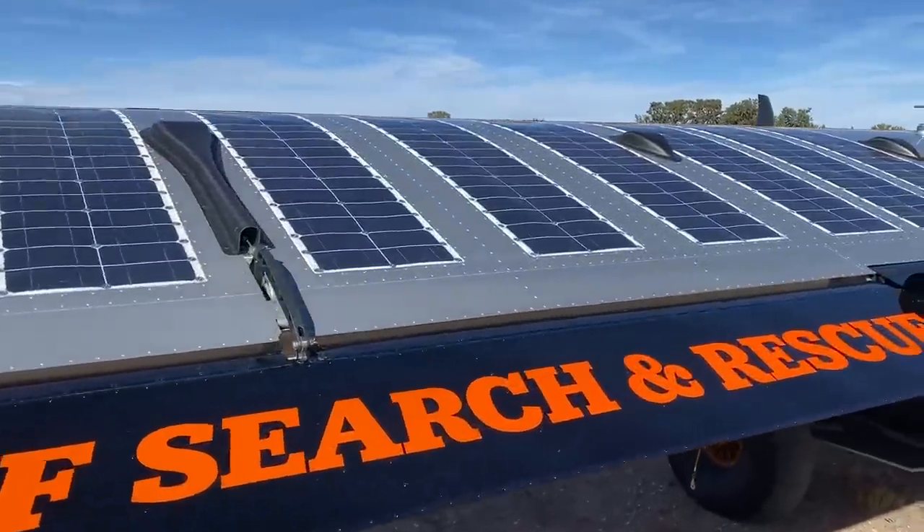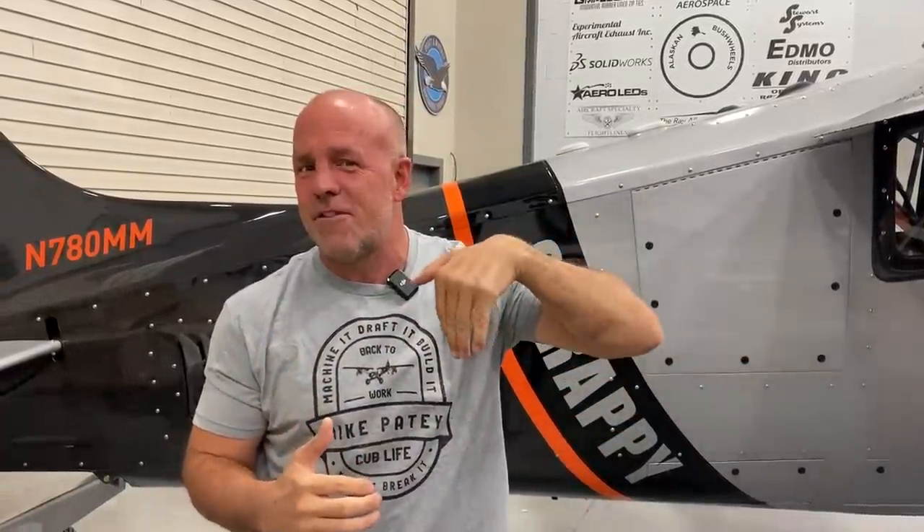Now it's time to kick it in gear because Garmin wants to have Scrappy back at Oshkosh this year with motorcycles hanging on it — last year I didn't have motorcycle attachments for the solar powered motorcycles. I need to get this done for Oshkosh, and I want to be done a month early if possible. So I'm going to two-stage this process: make a new motor mount, new cowlings, an intake scoop for the intercoolers, two new side entry doors, rearrange things to get the CG right for turbochargers — but I'm not going to put the turbos on yet. I just want to get room for the turbos, room for the intercoolers, scoops and intakes and outlets done, get the cowling on, get it painted, get the CG moved, rebalance, double check it, fly it, and go through the test flight period — then be done with at least a month left over for Oshkosh.